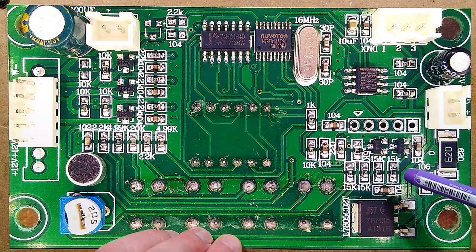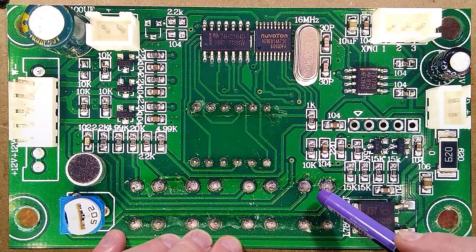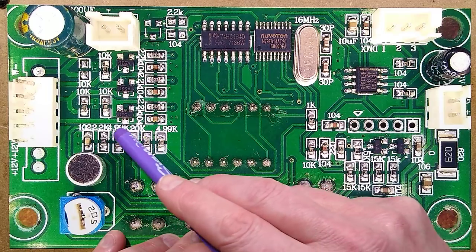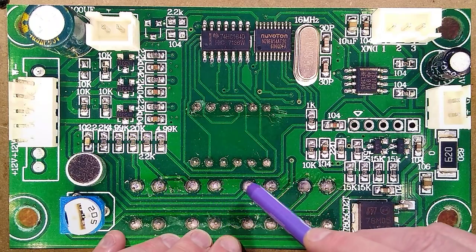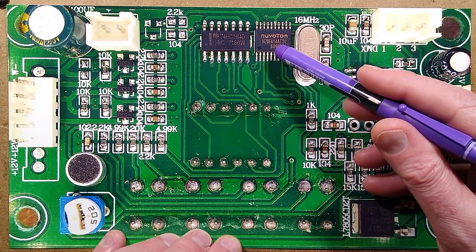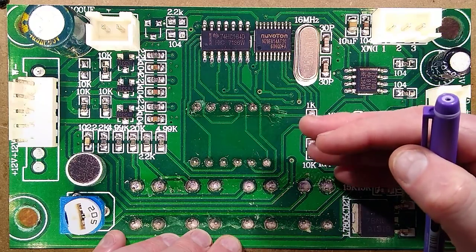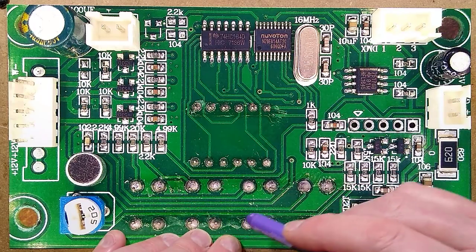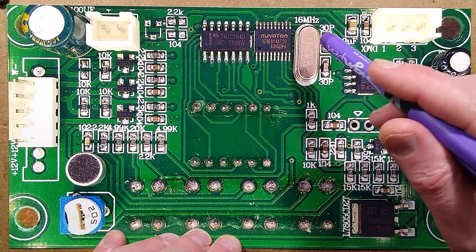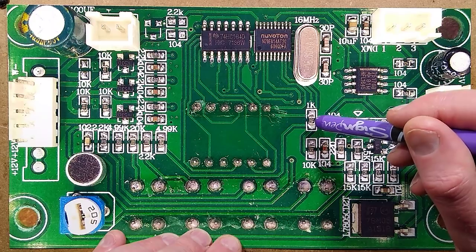There is a set of buttons, 1, 2, 3, 4 buttons, to keep that to a minimum as well. There is a voltage divider here. Each button sets a threshold voltage, which is then going to the chip and being detected by presumably an analog to digital detector. So it detects as a voltage level, a sort of a digital level, depending which button's pressed. So theoretically, mashing lots of buttons would have weird effects. But the processor will not necessarily recognize any of the other combinations.